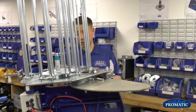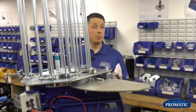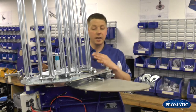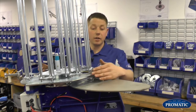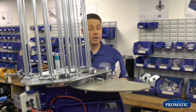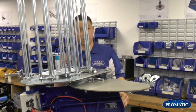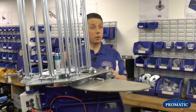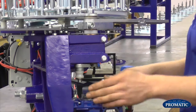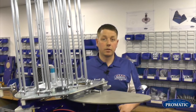For instance, if it was going over before it gets to the centre, that's probably why you're getting breakage of clays, because the arm is smashing straight through the clays. If it's going over later, what you'll find is you're losing distance, or you press the fire button and you wait a long time, then the machine releases. Basically what that is, it's gone over and it hasn't gone over what we call top dead centre, and that's what's causing it to come off the arm a lot later. And so we're now going to look at the Falcon for the timing on the arm.